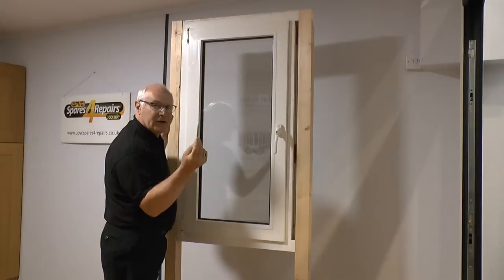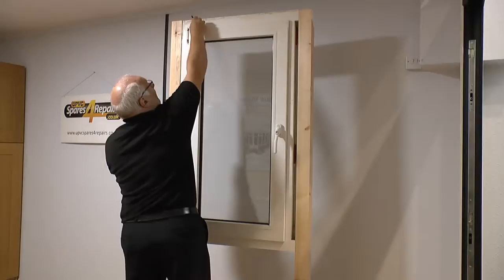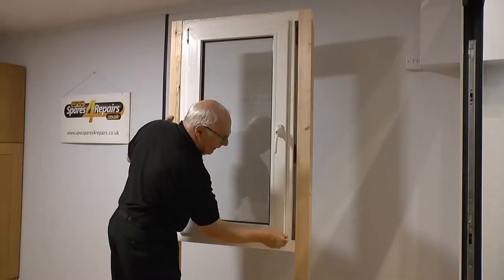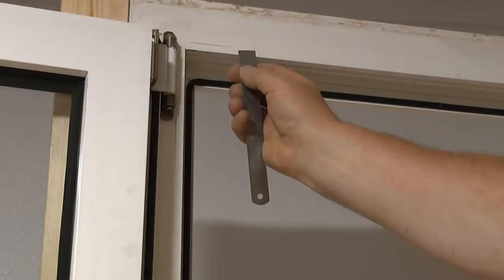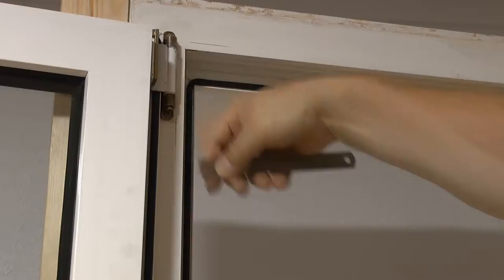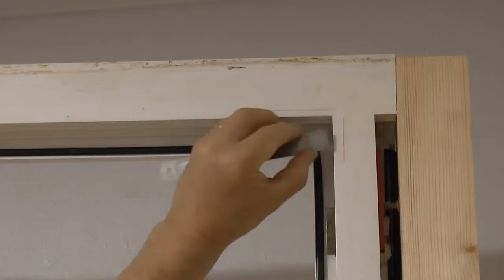The first job is to take a nice sharp pencil and mark the edge of the sash on all four corners nicely against the frame so that when we open this window we will be able to tell the exact overlap of the sash onto the outer frame. Having opened the window we now want to check the overlap distance — that is around about 8mm on both the head and the hinge side — and that is within a tolerance of 2mm. So now we are going to check the handle side of the window at the top for the overlap. As we can see this is already slightly lower than what it is on the side, so we have got less overlap at the head.